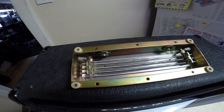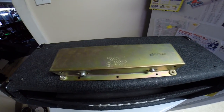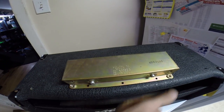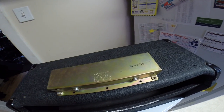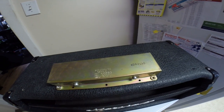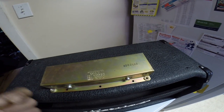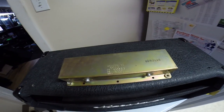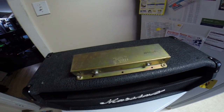So that's going to need some repair. An easy way to test this would just be to turn your reverb down and take the jacks out of here and just bypass. I had a red and black RCA connection, so take the black and unplug the red on the board, and plug black to black on the board, so you just have a jumper on the board. Turn on the amp, and if you get signal then, you probably got a problem in here.